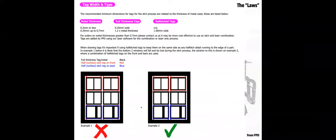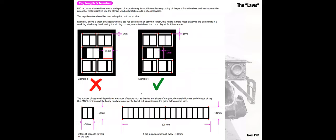This is on their website and they're happy to answer questions. On the example at left with the red X, you have a blue line signifying a half-etch on the back surface adjacent to a red line which is a half-etch on the front surface. If you think about it, if you do a half-etch from one side that meets a half-etch on the other side, that adjacent edge won't exist because you've etched it away. These are the types of things you need to consider — put your spatial thinking cap on.